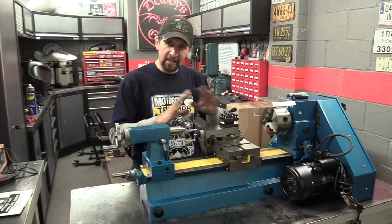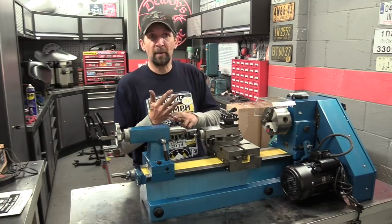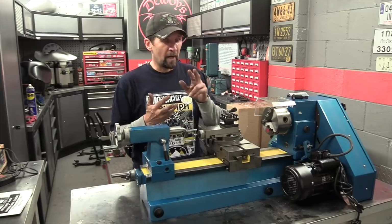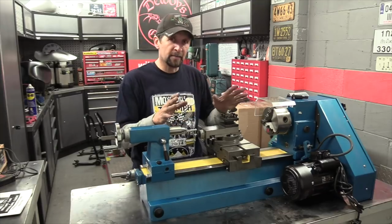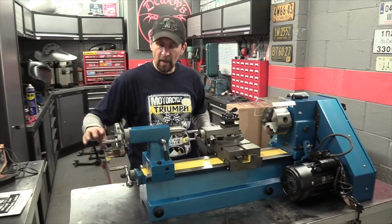I used a very fine scotch pad to release it. It was white spirit, WD-40. In one case I used a dab of thinners just to release it and it comes away. And then you can clean everything up and it's absolutely spotless. Then a coating of oil over everything. So it's all oiled up now. All the threads move nicely, the saddles move nicely, the slides. Everything's moving freely, superb, happy with it now.